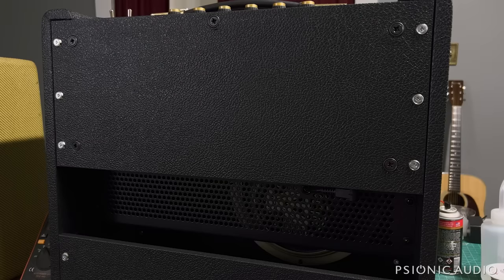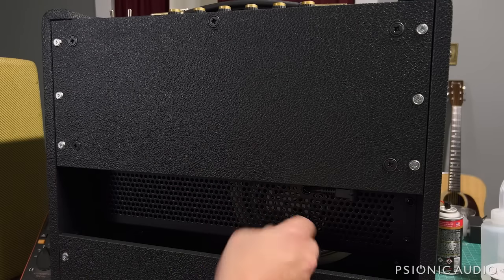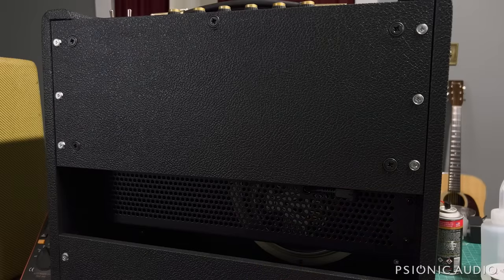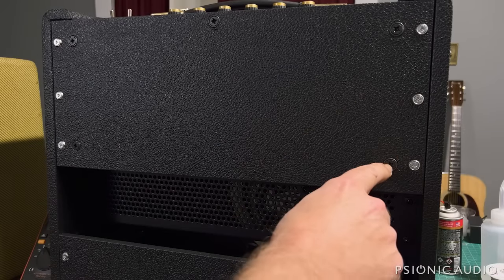All right, the rear is pretty typical for current Marshall. It's got this stupid metal grill. I'm sure it's so people can't reach in here and burn their little fingers on the tubes. Makes it really hard to change tubes on a gig. If you own one, I would suggest leaving this out. It does nothing except make things difficult. Doesn't have the prettier brass, but these screws will hold up better. A note on these screws that we'll get to in a minute.